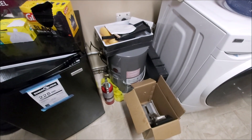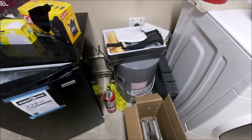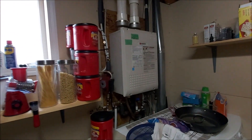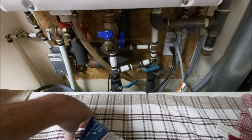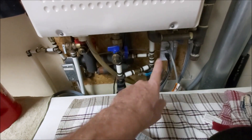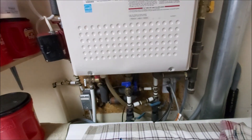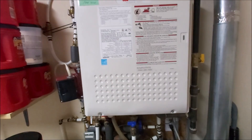Here's the 10-gallon water heater tank — it's in series with my tankless. If I hook that up to a lithium-powered power station that charges directly from the DC, I could preheat my water before it goes into my tankless. There are a couple of bypass valves — right now it's in bypass. To get water to go through the 10-gallon tank first, I close this valve and open these two, and it circulates through the 10-gallon tank first. If that's being heated from solar, when you call for water it would be preheated. There's your inlet right there.